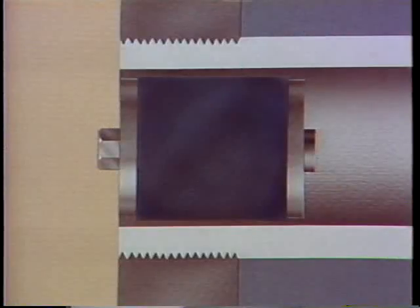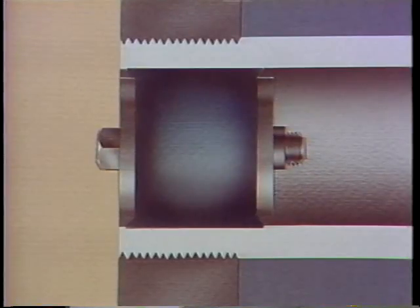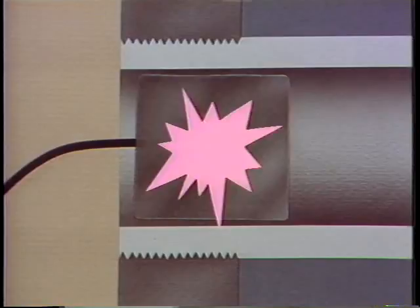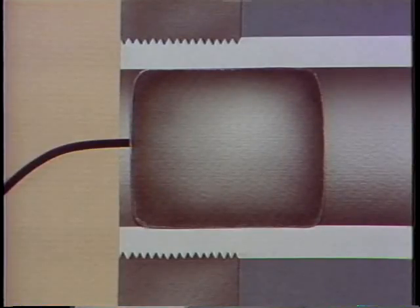Another type of plug sometimes used to seal a leaking tube is an expandable plug — these have a rubber donut sandwiched between two large washers with a bolt running through the middle. When the bolt is tightened, the rubber is forced to expand outward, sealing the tube tightly so the plug won't loosen and come out. For extreme service requirements such as high-pressure heaters in nuclear power plants, there are even explosive plugs that are detonated to expand them into place.